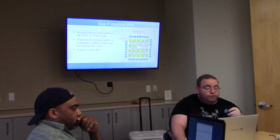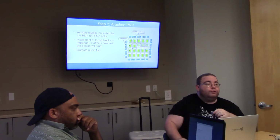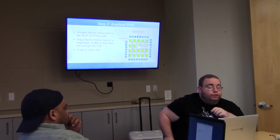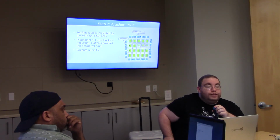That having been said, don't use Arachne PNR. Icestorm says that there are two PNR tools that it works with. One of them is called Arachne, one of them is called NextPNR. It doesn't tell you that you really want to use NextPNR. And I wasted most of Sunday trying to figure out that I really wanted to use NextPNR, because Arachne does not do tri-state pins. It just won't.